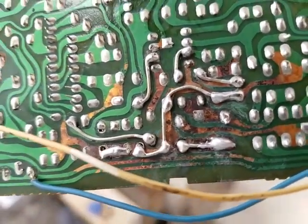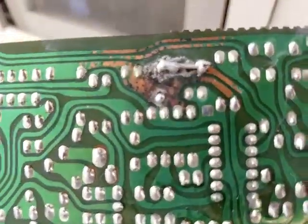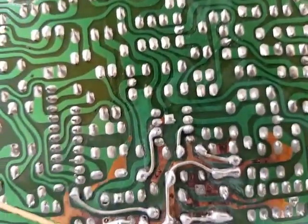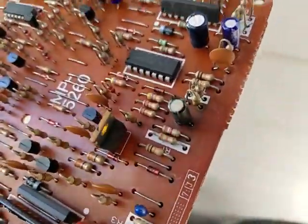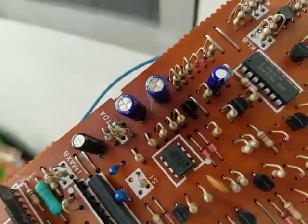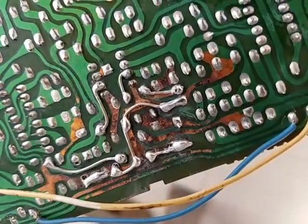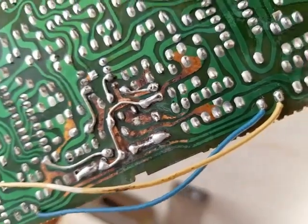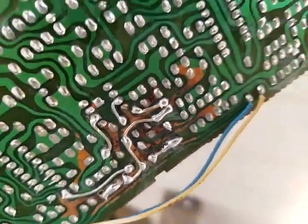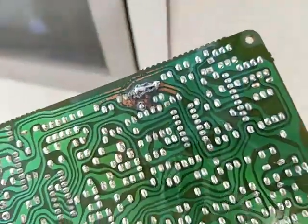All the broken traces have been repaired along with some wiring, and up here it needed some repair too. The capacitors have all been changed. The ones that were bad I replaced with used ones out of a TV, because I really don't expect this to work — the odds are 50-50 that all that leakage between the traces damaged some of these components. I know these are old analog components, but still — we'll try it.